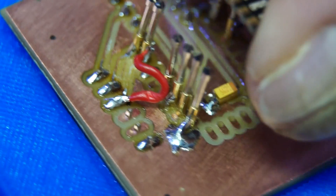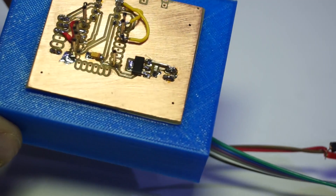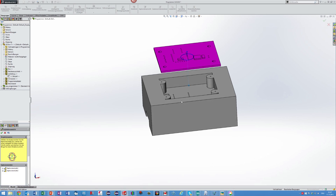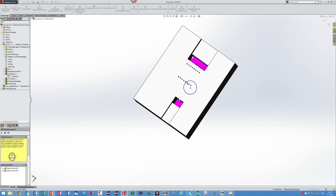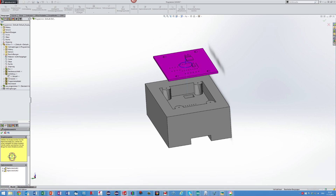The diameter of my pogo pins is 1.4 mm, which is very big compared to the pad distance of the ESPs of 2 mm. I found that thinner pogos exist and I ordered some, but for the moment I have to live with what I have. To stabilize the pogos I mounted them in a 3D-printed box. I heated them and pressed the board into the box — the back of the pogos melted the plastic a little and fixed them automatically.